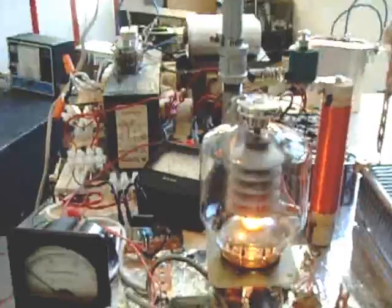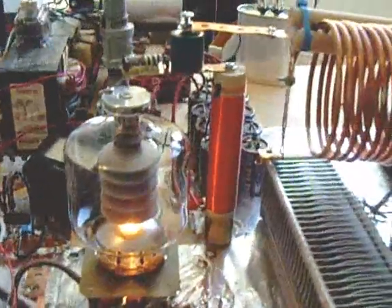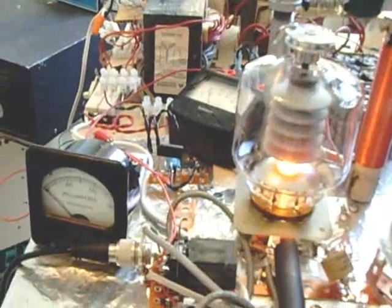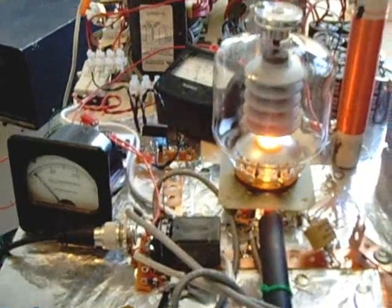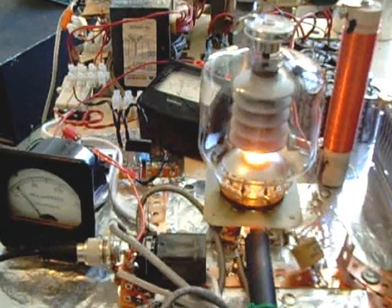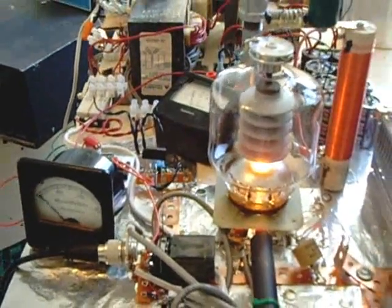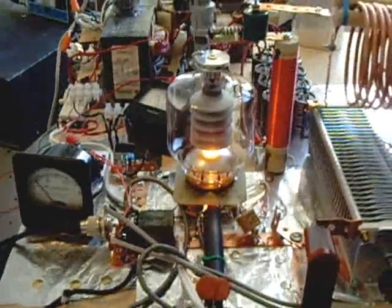There's our test of the amplifier using the 3-500C tube with the new 170 microhenry RF choke I made. The amplifier aptly puts out 500 plus watts as is. These tubes actually like to run better at about 3,000 volts — under those conditions they will produce more power, normally around 600 watts with no problem. This is the 3-500 test bed RF amplifier.